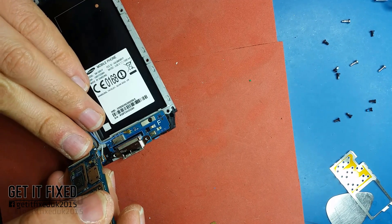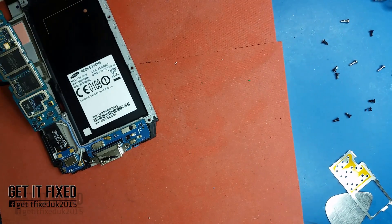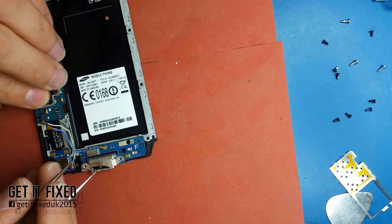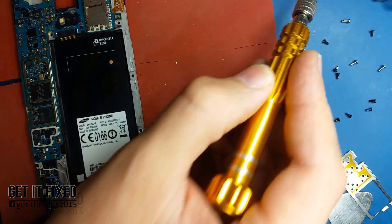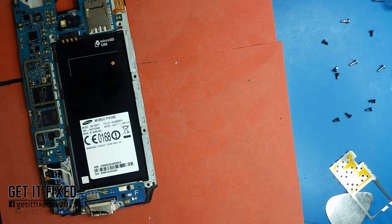I'm reconnecting everything back — putting back the charging port, which is really easy to feed in. What I want to do now is a simple test to check full functionality of the phone — specifically whether the proximity sensor still works, because I applied heat near the proximity chip as well. If that's damaged, I'll need to replace that chip as well.